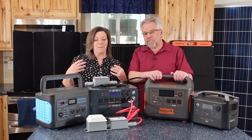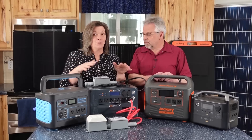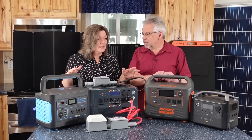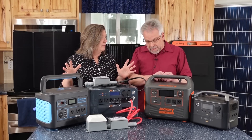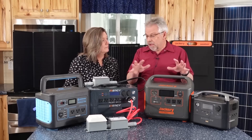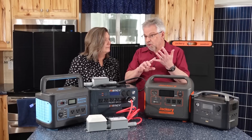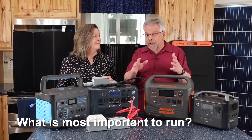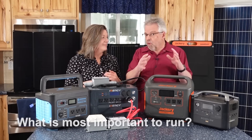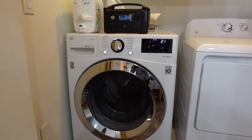What I'm most concerned about is whether or not, when the power goes out, this will take care of whatever I need. So how do I know which one is going to work for me? That's one of the biggest questions out there — there's just not a clear understanding of how to figure that out. The first thing you need to do is decide what are your critical loads, what is it that is most important? Unless you're independently wealthy, you're not going to have a system big enough to run everything you want to run. So what's most important? My freezer, my washing machine, my bread maker, and actually a nebulizer — it's a breathing treatment.